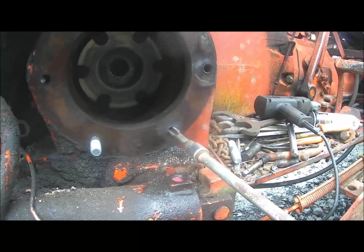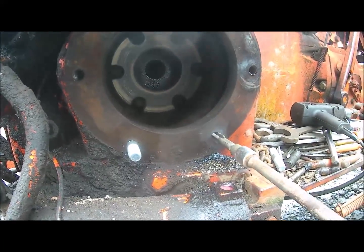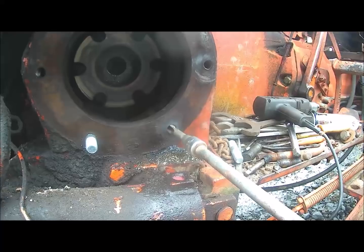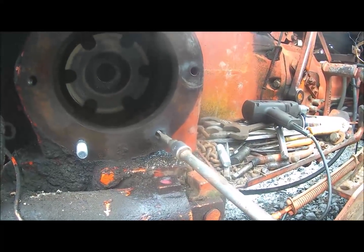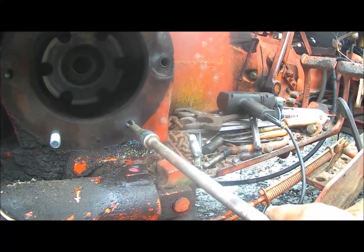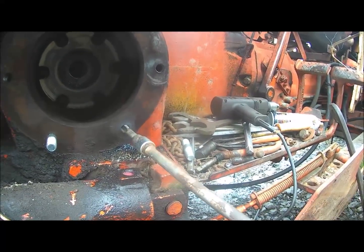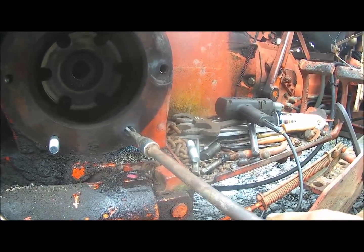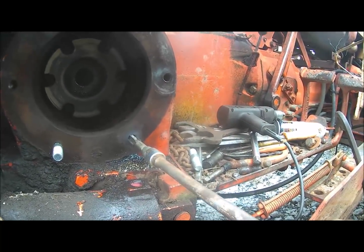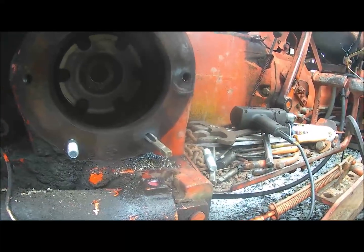Yeah, I guess this is as good as any way to clean the threads up. I know I done that one, and I can put the stud back in with my fingers. Got a little tension on it. Must be them threads boogered up just a little bit. Yeah, we'll get the thing back out of there. It's the one we had to drill out, easy out so bad. It must be distorted a little bit on the inside there.